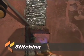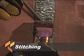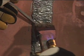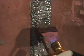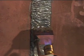One method of stitching is called a butterfly stitch. The concept is like making a series of X's across the seam. When the solder solidifies, the surface of the stitched joint appears to have ridges of solder perpendicular to the seam opening.